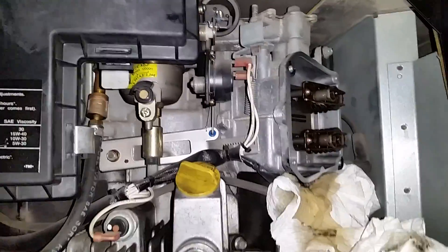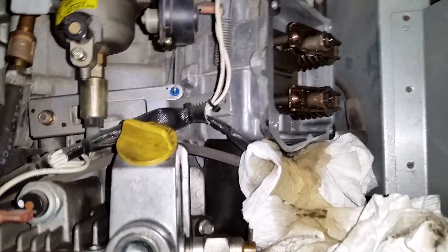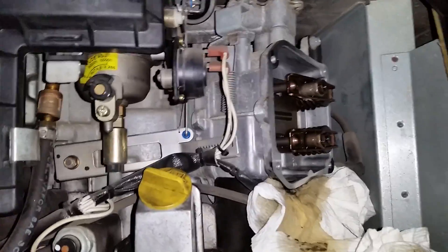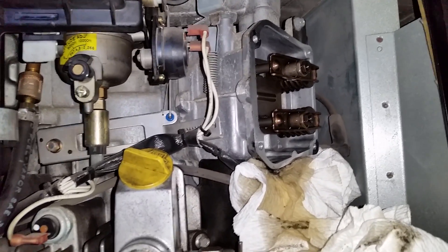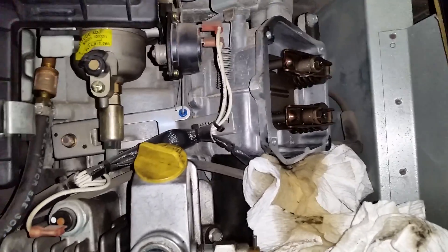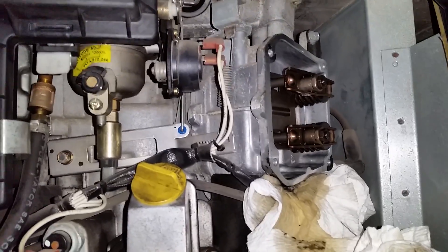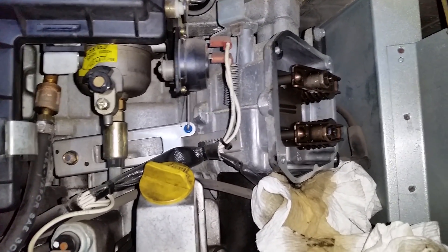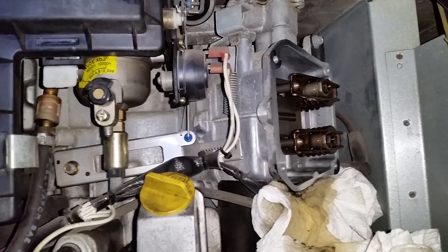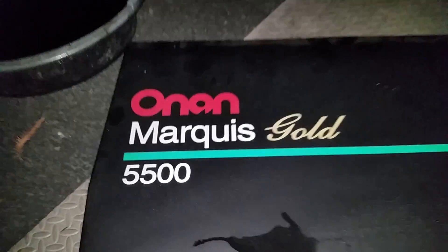It's a late night and I'm working on my own generator. Earlier today I changed the oil, and when I came to start it up to get everything warmed up before draining, it just sounded loud to me — like tapping, like it had excessive valve clearance. I looked at the factory repair manual to see how many hours they recommend to adjust the valves. By the way, this is an Onan 5500 series.